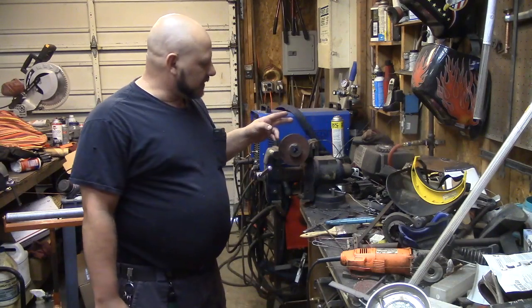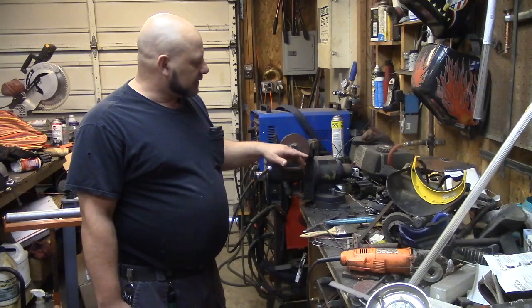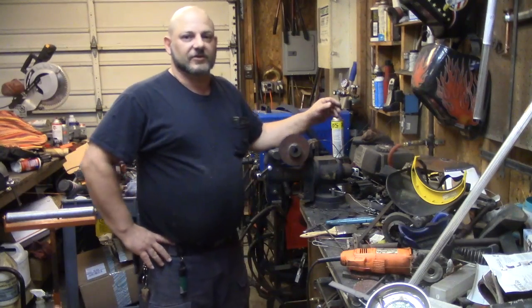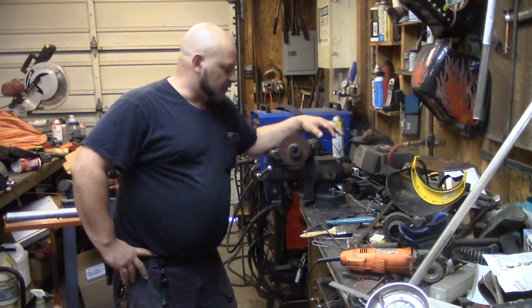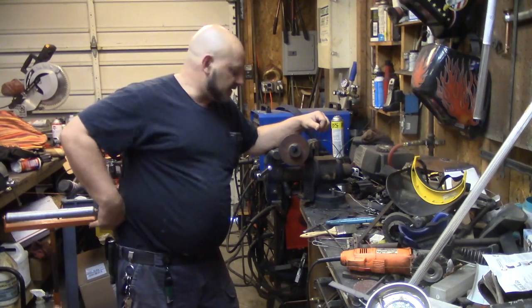The first one being, when I first used it on the new motor, I bored out the bore for the slightly larger shaft. I think it was a 3/4 shaft. And now I've got to put it back onto a 5/8 shaft motor. So I need to make a spacer or a sleeve or something for that.